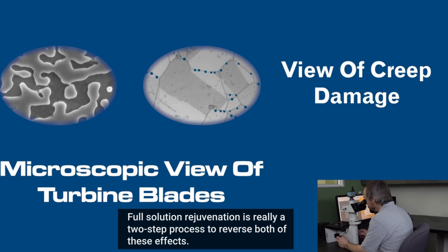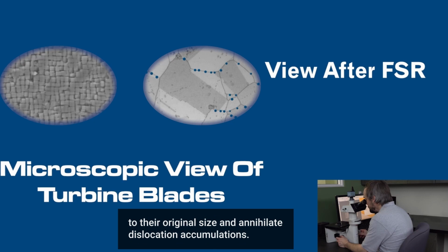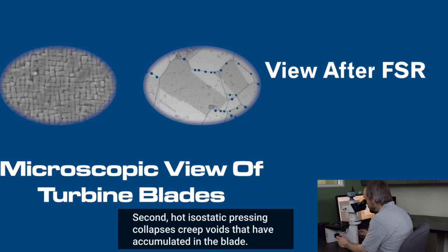Full solution rejuvenation is really a two-step process to reverse both of these effects. First, heat treatments are used to dissolve and regrow the strengthening precipitates to their original size and annihilate dislocation accumulations. Second, hot isostatic pressing collapses creep voids that have accumulated in the blade.